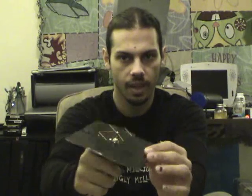Now, creating this, there are a couple of ways of doing it, and there are instructions on the internet. One common way, which I'll put a link to in a video in the show notes, is using a copper PCB board. You drill a hole through the center. If you notice, I've got some nice silver marks here, so I can actually get nice 90-degree angles, so I know exactly where my dead center is. And I used a through-hole panel mount to affix the panel mount end connector. Now, you take a PCB and you drill through it, and you get a copper pipe, and you feed that. You solder the copper pipe through the hole. The copper pipe acts as the actual separator, and then you solder everything together.